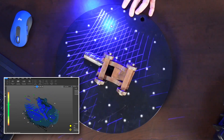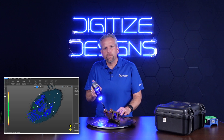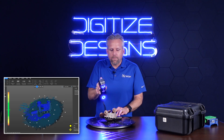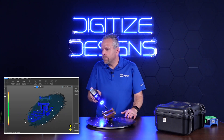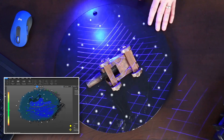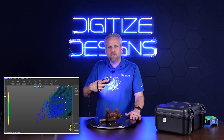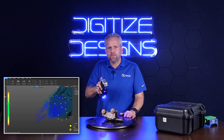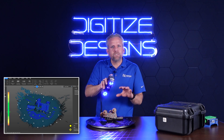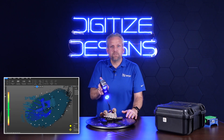You see it's acquiring the markers at the same time it's actually scanning. If you're scanning for very high accuracy for metrology-type applications, it's probably best to scan the markers first, and also if you want to use a clipping plane. One big advantage of markers is that if you lose orientation — if it can't see enough markers — it just simply stops scanning. I have no markers on myself, so I can spin this around completely. As soon as it comes back, it knows exactly where it is in space, so I don't have to worry about overlapping geometry like with other scanners.